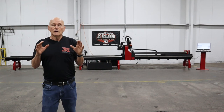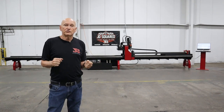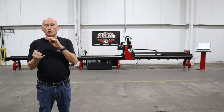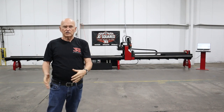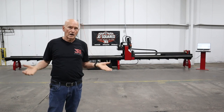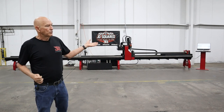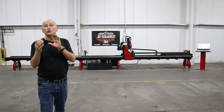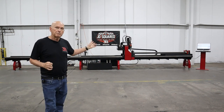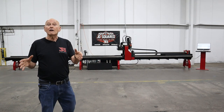The XR6, however, was actually designed as a member of our new extreme platforms, so it isn't limited to just plasma cutting. It will wood carve — I can make about a 10-inch diameter wood carving like exotic columns. We can mill PVC pipe, aluminum tubing and pipe — we don't plasma cut it, we actually mill it. We can also plasma cut, draw, scribe, cut flat material, and route flat material.